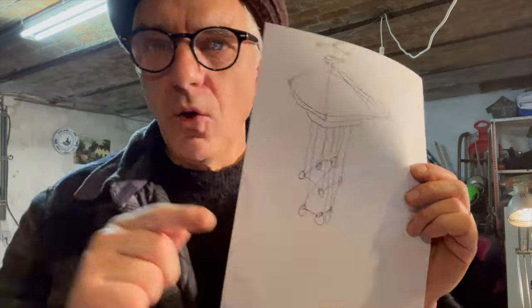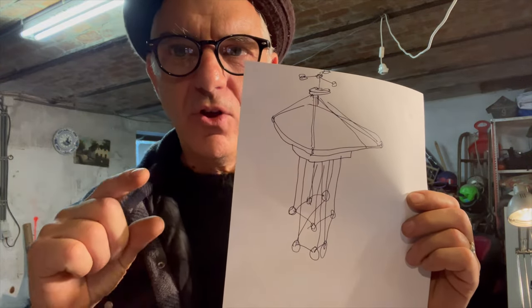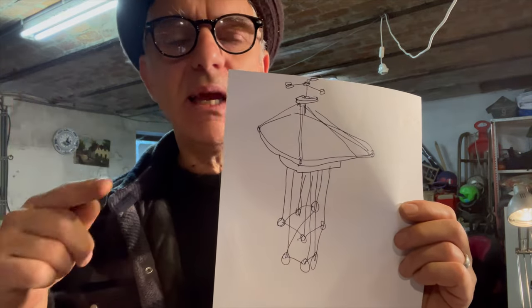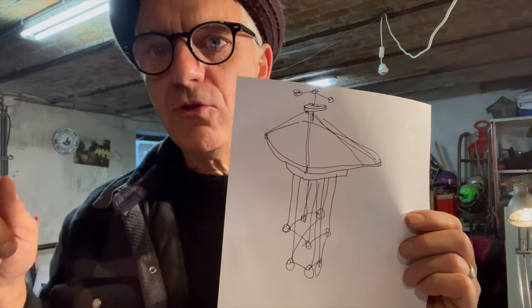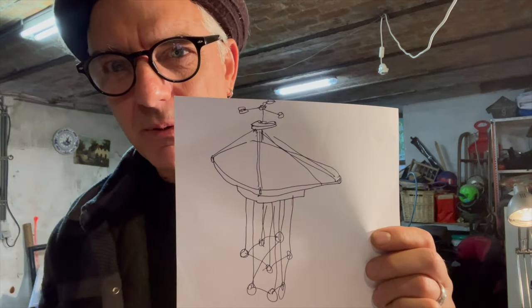So I think I'm going to play with the code and wire the piezos to different pins. So I can then direct in the code different notes to different piezos, so they'll fire individually, and perhaps we're getting multiple voltage because we'll get the voltage off each pin firing rather than halving the voltage because they're sharing a pin, I think. Let's give it a go and see what happens.